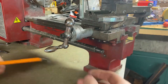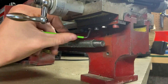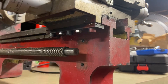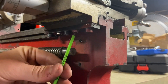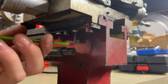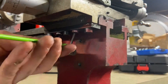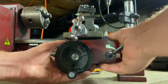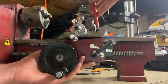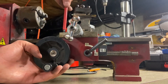Even here I have to take the entire apron off the side of the lathe in order to tighten this side of the gibs for the main ways. It worked — the gibs tightened down and worked much much better after a little bit of a tune-up — but it was just kind of amazing that so many pieces had to come off to do fairly basic calibration. With all that said, it really is pretty amazing that this entire machine can be built and sold for something like six hundred dollars. It blows my mind that they can do it that cheaply and still make money on it.